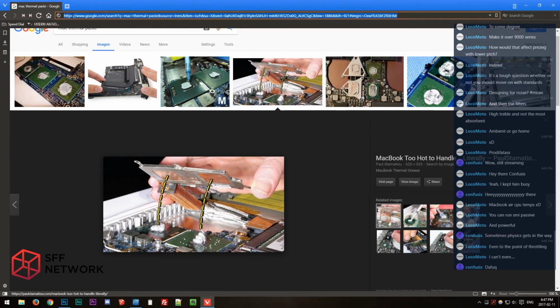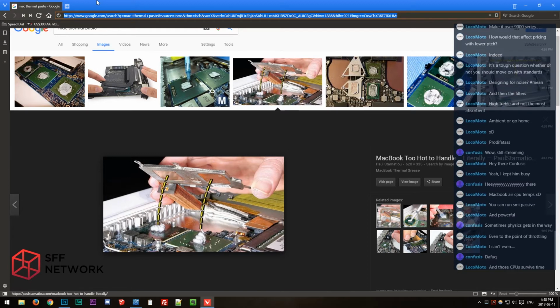But yeah, laptops, definitely, because they're designed and spec'd by the OEMs, they're much less oriented on maintaining super low temperatures like enthusiasts are with their desktops. So on laptops, it's not too uncommon to see temps of 70, 80, even 90 degrees if it's a high-end processor in a really thin laptop. And I think people could stand to learn from that for desktops.